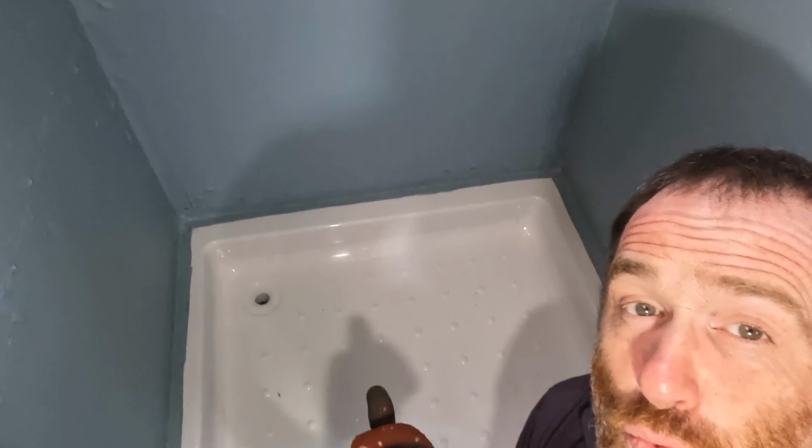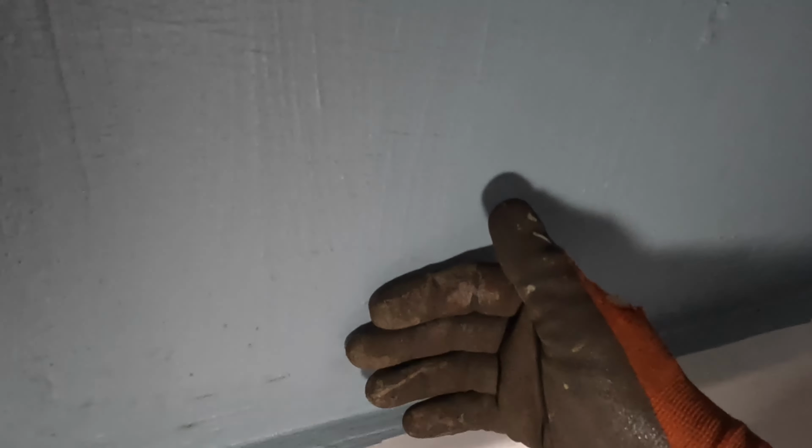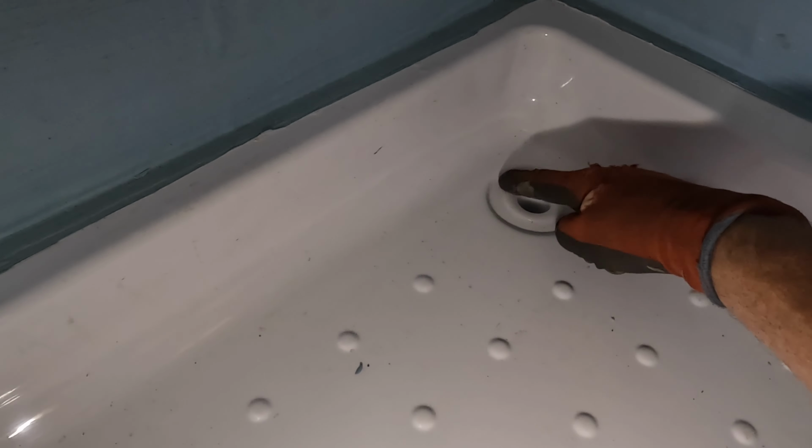So now this is waterproof. Any water that goes along here, through here, past there, in, is now entirely sealed and is waterproof. In fact, the weakest point is probably that seal there. As I install the copper, I'm going to be doing it like roofing, so it in itself will be waterproof as well. So there's two barriers to prevent water getting out: the copper and the tanking. So as long as I don't, whilst installing the copper, pierce it, then it's waterproof.